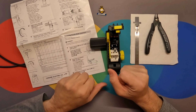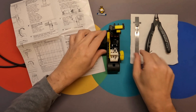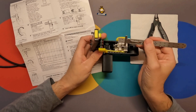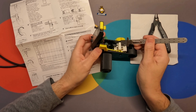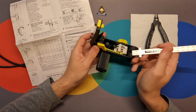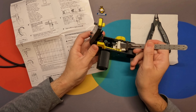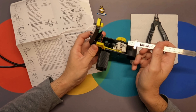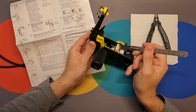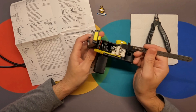When looking at the screw height settings, you can start with screw A, which is the overall screw. For the L3.3 CuHD, this one needs to be 8 millimeters high, or thereabouts. Screw B left should be about 5 millimeters. Screw B center, or middle, should be 3.4 millimeters. And screw B right should be 1.6 millimeters high.